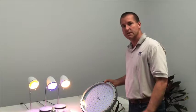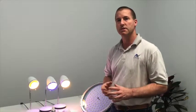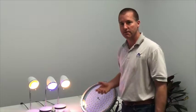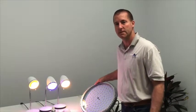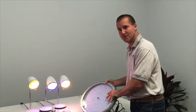The other benefit of an LED is that they last much longer and they don't fade as quickly. A high bay metal halide light starts to lose performance the day you install it, and by the time it blows it falls down to about 60% of its brightness. Not very good in the warehouse, not very safe, but it's all we've had until now. These LEDs last about 50,000 hours compared to 5,000 for a metal halide. So much longer life, but also they don't die as quickly.